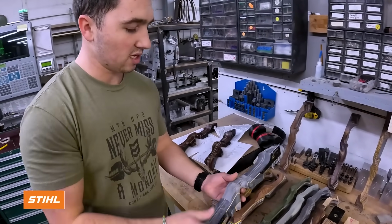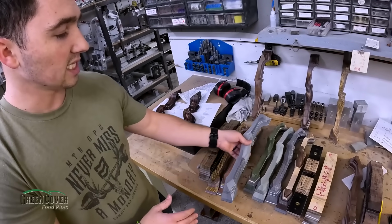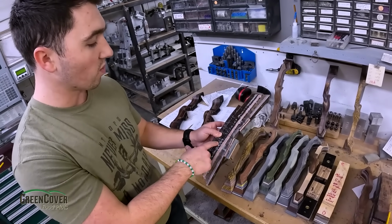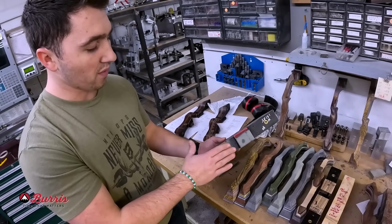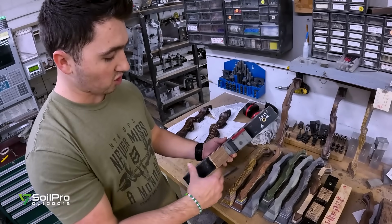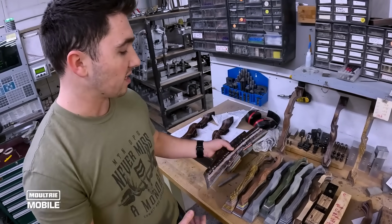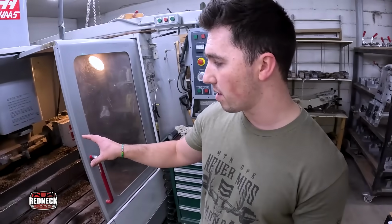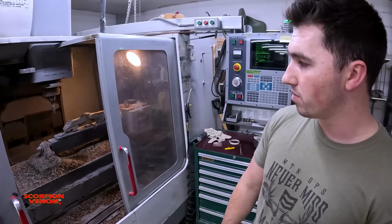Same thing with the G10 risers. They go in as a block and they'll come out as this. And this is after all the layers have been glued up. So we've layered in all the glass and all the woods, layered them all up, glued them down. You can see all this glue that's hardened on the side. We've glued in the butt blocks. We've already cut and drilled into the mounting holes and put in the inserts. This is where the limbs will mount up and actually screw into the riser. So we've already got that done, and then it's ready to be profiled. This is the longest program that we run. Each riser takes about 45 minutes, give or take the model and the grip.